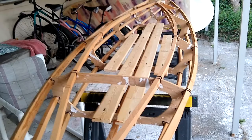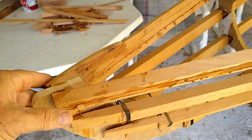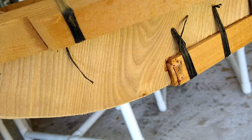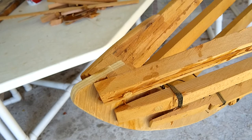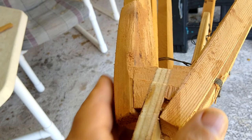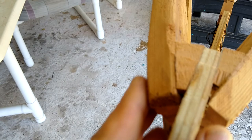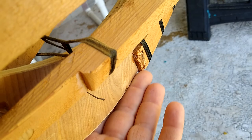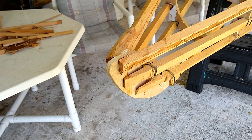It's time to figure out how to get a skin on this. The instructions call for this area to be faired — these sharp edges can obviously puncture the cloth on all these stringers, and down here where the keel meets the stem, and also the same thing in the front. I've done quite a bit of work to reduce this — cutting these on angles, trimming, and doing quite a bit of sanding — but I think it's still going to be a little bit of a problem.